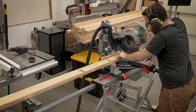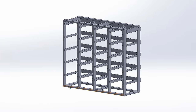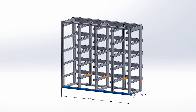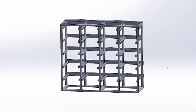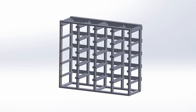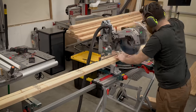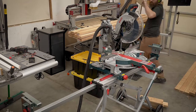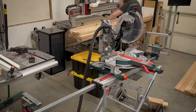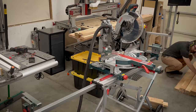I'm going to start by cutting out all of the pieces to the frame. All the horizontal pieces are 82 and a half inches, and there's a total of nine of these — four for the actual frame, then five that sit across the back for stability and as end stops for the totes. All the vertical pieces are 67 and a quarter inches, which are the vertical supports front and back. I do have full plans available on Printables — I have the full cut list so you don't have to follow along, you can just look at that link. The nice thing about having a miter saw is you can set up a stop block and cut all the pieces at once, knowing they'll be the exact same length.